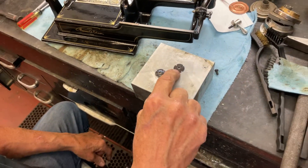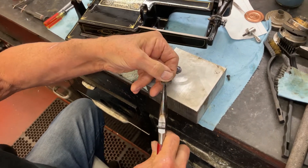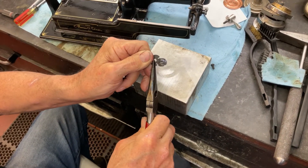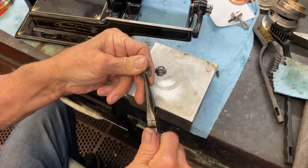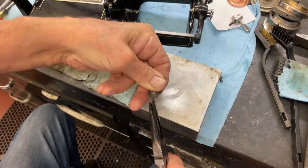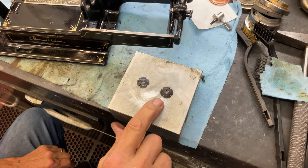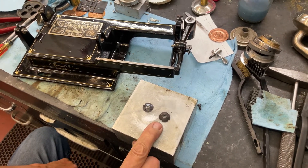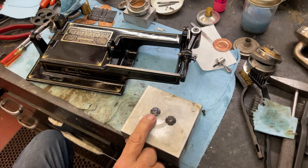What do we do if we have a flat spring that goes on top of the gate? You take a pair of needle nose pliers and you just take this, hold here, and then you bend over a little, and you keep bending the same distance until you get it to bend. You can see how this one's not fitting flat. There — see how that's bulgy? This is an original. So what you got to do, because we're doing a restoration, if your little spring on top looks cruddy, you can just flip them around — put the old one on the bottom and the nicer looking one on top.